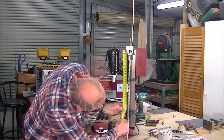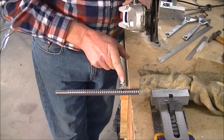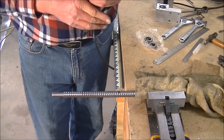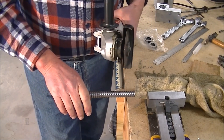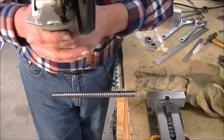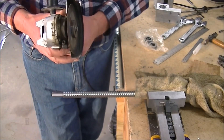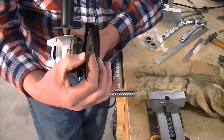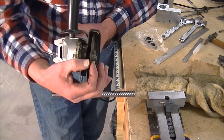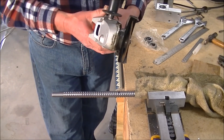I'm going to cut that screw off at 390, actually I'm going to make it 400 and if I have to trim it back a little bit more I will. So I've marked the ball screw exactly at 400 where I want to cut it off. Now, if ever you need to cut one of these, they are extremely hard material on the outside - the central core is a lot softer. You need a slitting disc or fine cutting disc like this one-millimetre one. It's because it doesn't build up as much heat into the material - you really don't want to let this thing go blue.